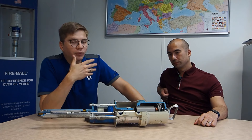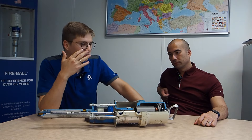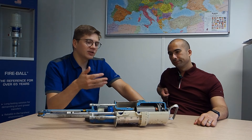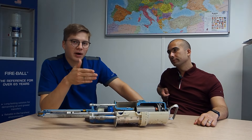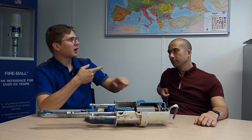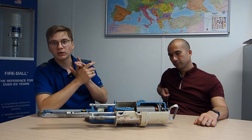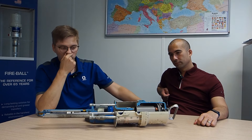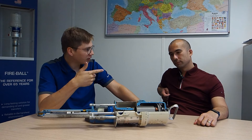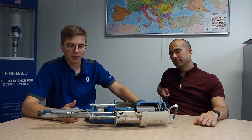How does the pneumatic pump work? In a nutshell, there is an air inlet and a fluid outlet. These pumps have different pump ratios - what is the pump pressure actually? There can be 1-to-1 pumps, 3-to-1, 5-to-1, 10-to-1, 50-to-1, 36-to-1 pumps. This is the ratio between the effective area of the air motor and the effective area of the lower part of the pump.